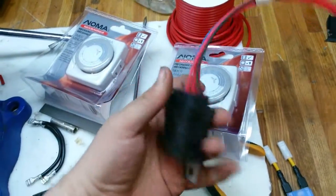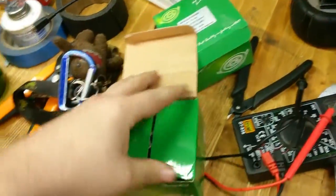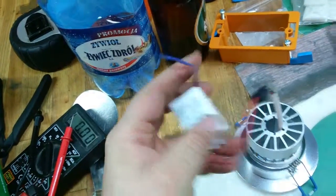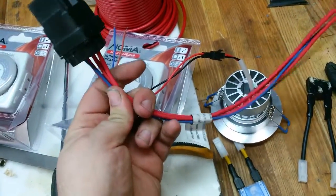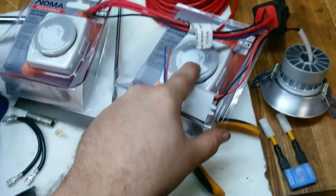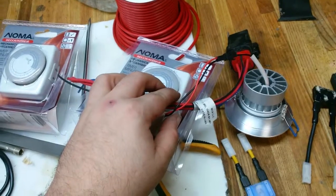What am I going to use to discharge it and what to trigger it? These little LED lights here are pretty strong — like two or three amps a piece. I've got a little 120 to 12 volt module LED driver, so I can plug that in and use it to drive the relay, and then use the relay to drive something else. This is going to be hooked into line power — house power — both of these. I'm going to cobble that together and see how it works.